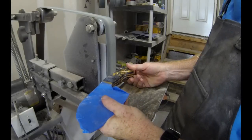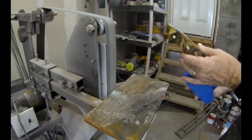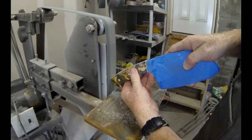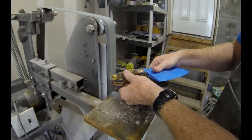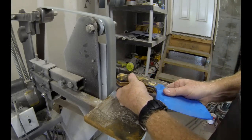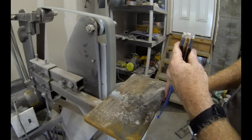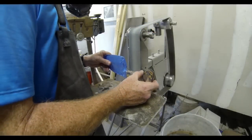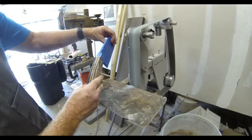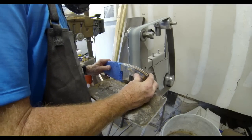Now once the epoxy is dry, you can work these wood chip micarta scales just like you would any knife handles. You can shape them with almost any woodworking tool. I'm using a 2-inch belt sander to bring it into the basic shape, pretty quickly. I also use a Dremel grinder to round over all of the edges and shape it so that it feels good in your hand. And then you can use an oscillating sander, and you can use sandpaper, etc., and eventually a buffing wheel.